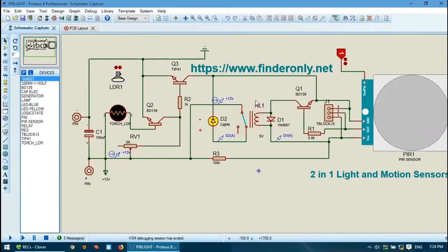There are a few things you might need to know. First, RV1 is a variable resistor, trimmer, or potentiometer. The higher the value, the more sensitive the light sensor will be. You can change this value to any value you like, or simply use a potentiometer to make it easier to adjust.